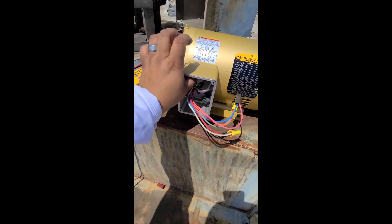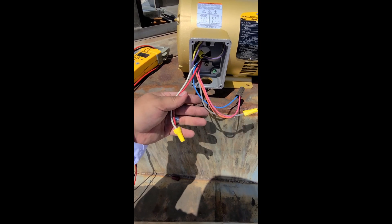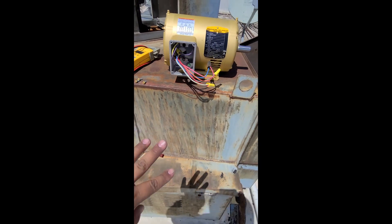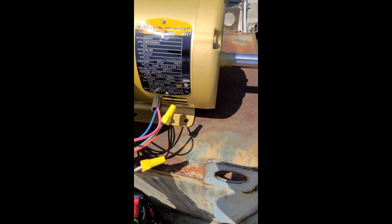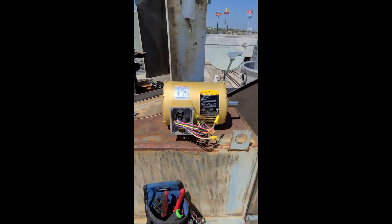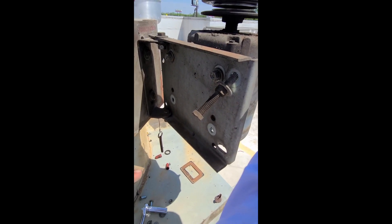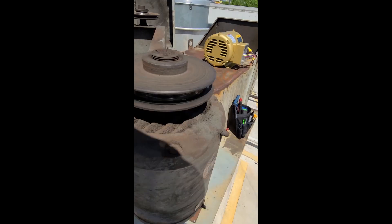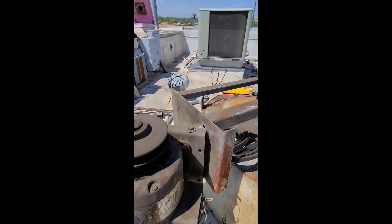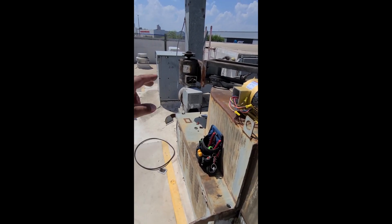In my case we've got three-phase power, so we're going to connect one, two, three. The phases of power should not matter for direction initially. Let me double-check — it's 120 per leg, giving us 208. I'm going to leave the bottom two bolts to suspend the motor so I can work on it in a good position. Wait — this thing's live; I forgot I was testing those legs. I'm going to go shut that off before I hurt myself, and then I'll unscrew those two things and drop it out.